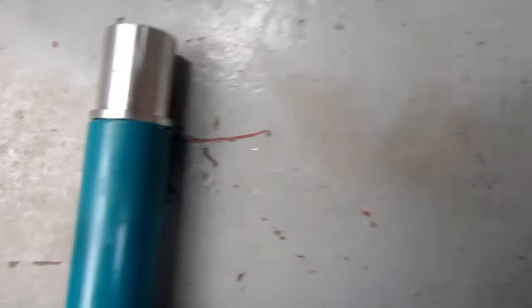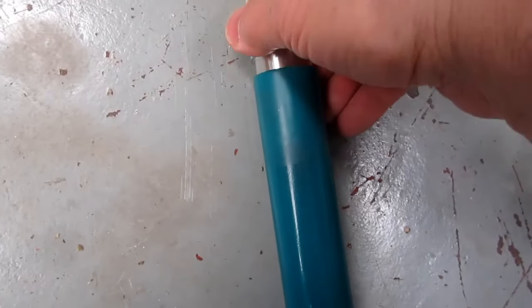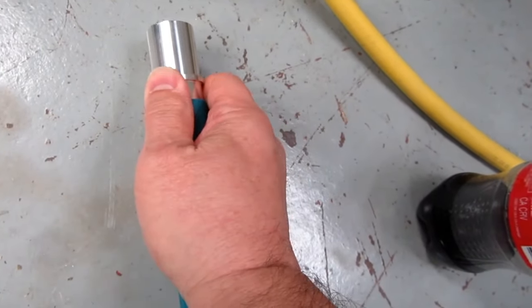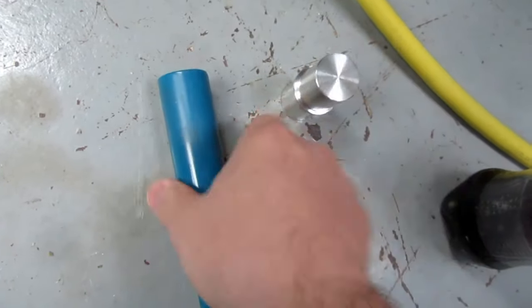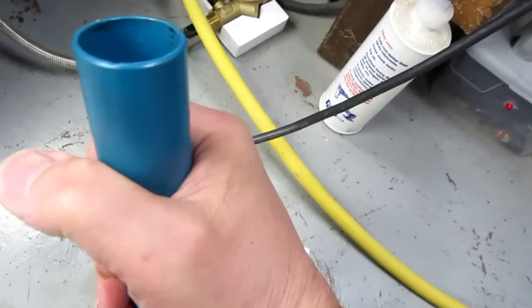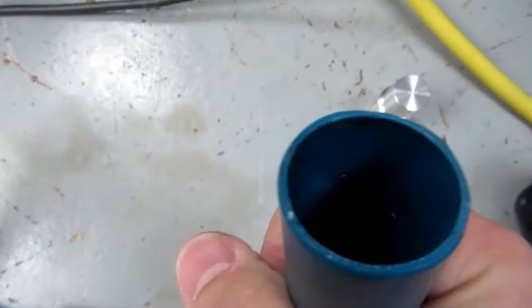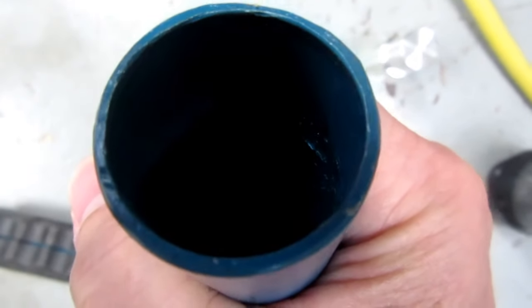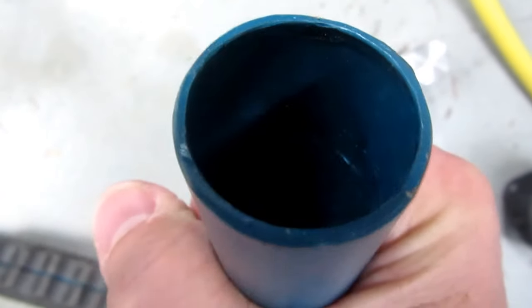And on one side, they fit in just perfectly. On the other side, the tubing is a little bigger or a little smaller, or it's slightly out of round, or maybe it's just the welded seam. I think there's a welded seam inside these. Yeah, the tubing is rolled. So it's probably easiest to just go in here with a Dremel sander and take it down a hair, shoot it with a bit more touch-up paint, and then hopefully everything will fit well.